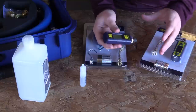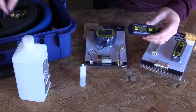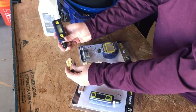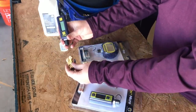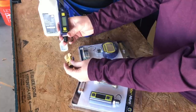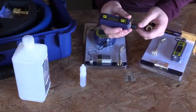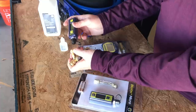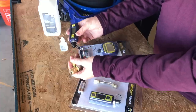What we learned pretty quickly is that they have to be cleaned periodically. The first tip is that when attaching a micron gauge to a core remover tool, you want the core remover tool oriented so the micron gauge can sit upright. That way oils and contaminants are less likely to get in. Keep the gauge cap on nice and snug when it's not in use.